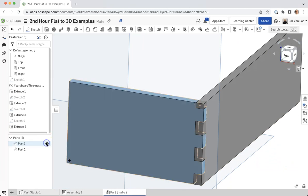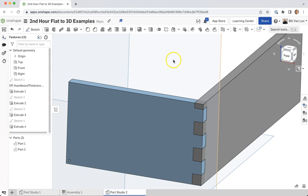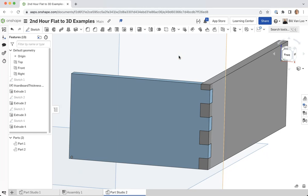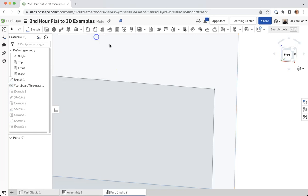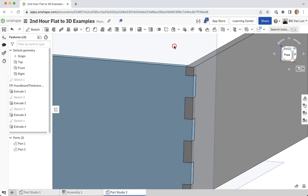I've got two parts that are perfectly matched up together. When I go to laser cut these they should have the exact correct dimensions. But if I measure my cardboard and find it's off — say I've got a super enormous piece of cardboard at 0.18 inches — when I click the green check, if I've modeled this correctly, everything still just works. Everything automatically updated, and it still fits together no matter what the thickness of the material is, as long as I'm using that variable to drive the sketch dimensions and extrudes that rely on cardboard thickness.